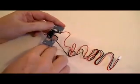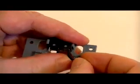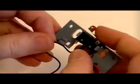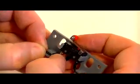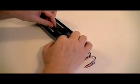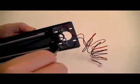With the limit switch holder with the switch toggle roller to the left, press the switch firmly down into the jaws and onto the two support pins. Press the red and black wires down through the jaws at the sides of the holder. Align the limit switch holder with the ends of the two shaft fixing bases so that the toggle roller faces inwards. Fix the holder to the Y gantry bottom cover with two bolts.